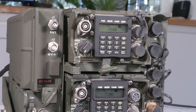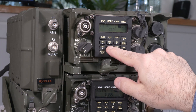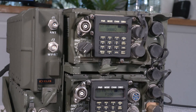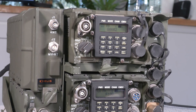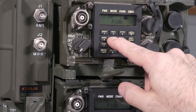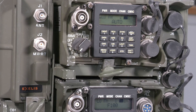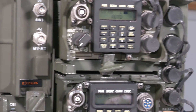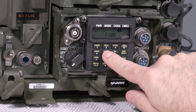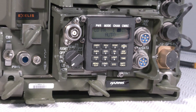Let's do the same to the top radio. We are in load. We go again to set a Combat ID — set it to two. Now we go to GPS, which is off, and change it to auto. It's already showing plus auto, because in this time the bottom radio has already synced. So these radios are now ready to go — it's really as simple as that.